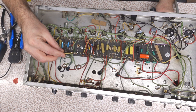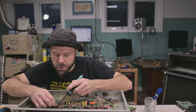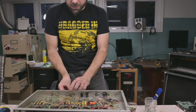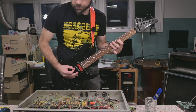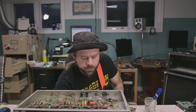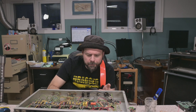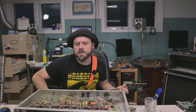Wait — where's this wire go? It goes here — that's part of the preamp power circuit. Wouldn't that be funny: go to test the amp, and it's not working because we've got no power to the preamp. Let's give her a quick plug in and see what happens. My speaker wire just reaches. We're getting no sound. What did I mess up? Oh — we've got no power tubes in there. That might help if we had the power tubes in place.